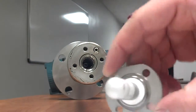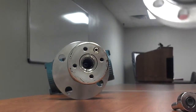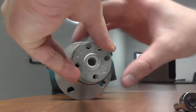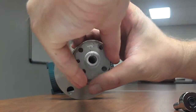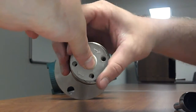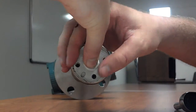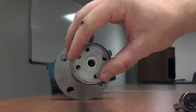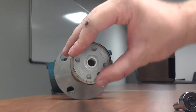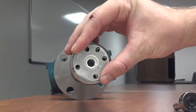Now you're ready to install your O2 cell. Take your O2 cell and your new metal O-ring and put it right on top, laying in the groove. Make sure it stays in that groove and put the O2 cell in twisting clockwise. The metal O-ring may fall down a couple of times — just make sure it's up and laying in the groove when you're pushing it in. If you pass the holes, don't turn it counterclockwise — just keep turning clockwise, because going counterclockwise will mess up contact with the contactor coil. Keep turning clockwise until you get the holes lined up where you want them.